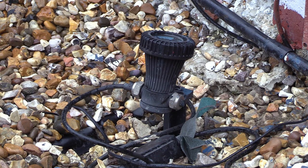If I had taken all the lamps out and then left them out, I wouldn't have known which one had a problem. But by leaving them in and then removing the dodgy one, it meant all the other ones lit up when I removed the dodgy one.